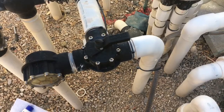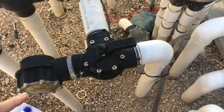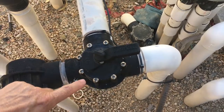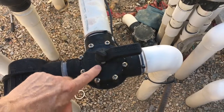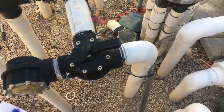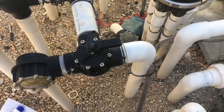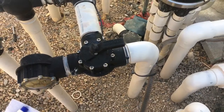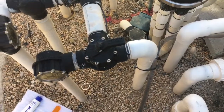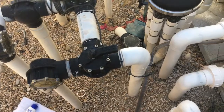Why would you want to do that? You're probably having one or a couple of different problems. Most likely is you're getting water leakage around the upper cap here, or perhaps out the stem of the valve. Another likely problem is that you're drawing air into the filter system, into the pumps, and this is caused by degraded O-rings. It introduces air into the system and causes the pool to bubble up with air bubbles and also gurgle when it starts up.